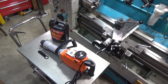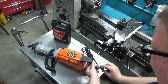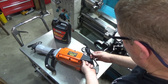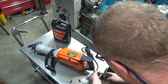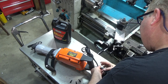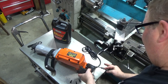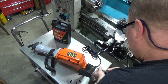The oil wicks through a cotton wick inside into the main chamber where the motor drives the offset weight. I wanted to pop this open but it proved more complicated than I thought — I assumed the top cover would come off with the six bolts and two screws holding the rear handle, but I was wrong. It turns out the top is actually the offset weight: there's a disc inside that's an offset weight driving the piston down the main column, and that offset weight counteracts the piston so you don't have too much vibration. Unfortunately it's attached to the top lid and won't come off.